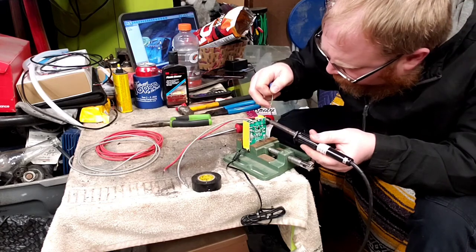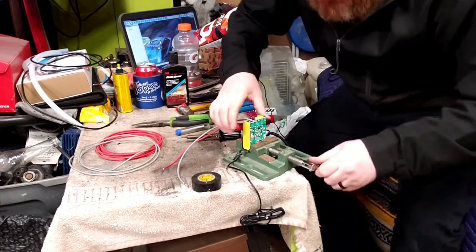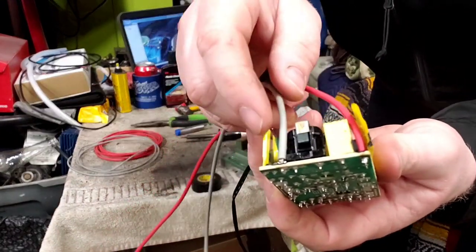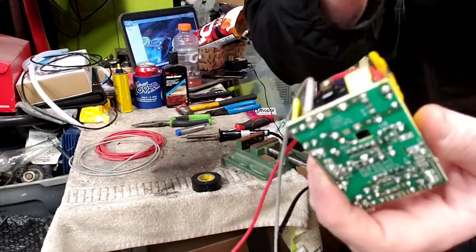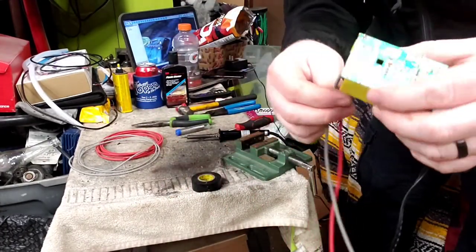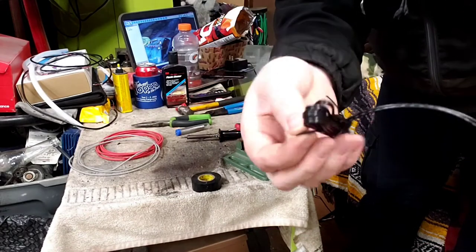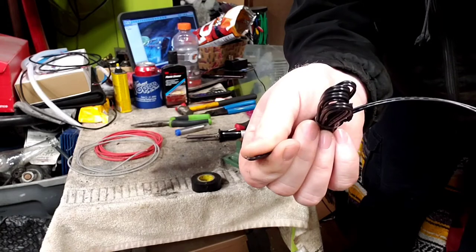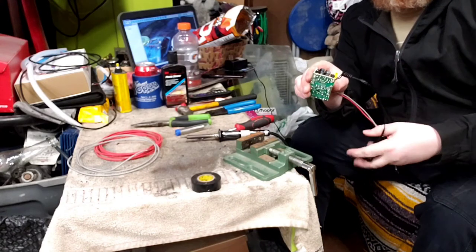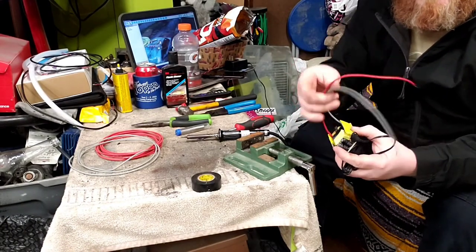I got this end stripped a little long and the other end stripped really short — the short end is going to go right into the circuit board, and the long end is going to get twisted together with the wire nuts on the actual light. I'm just going to go ahead and get these tinned in. Just got to find the right little hole. I would have used thinner wire — it would have been a little easier; this wire is a bit big for the hole, but with a little prodding I was able to get it in there. It is a little sloppy on this end, so I'm going to add a little extra solder just so I know it's got a good connection.